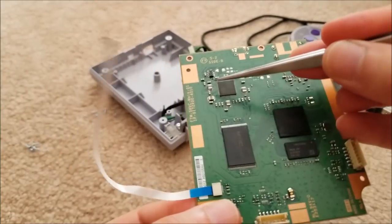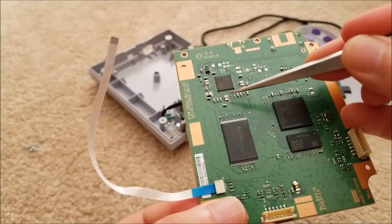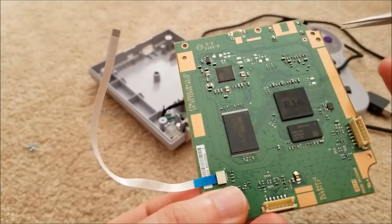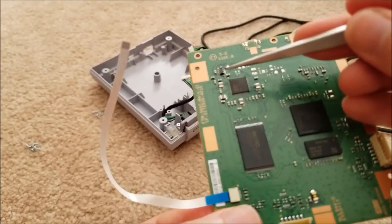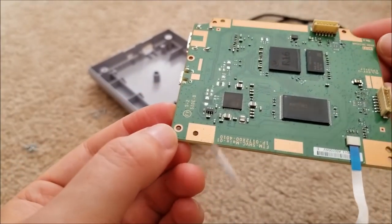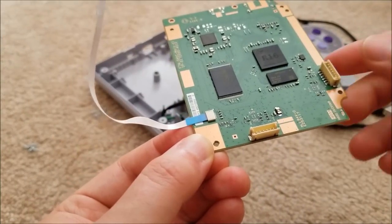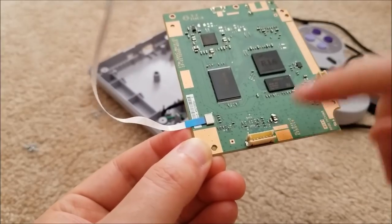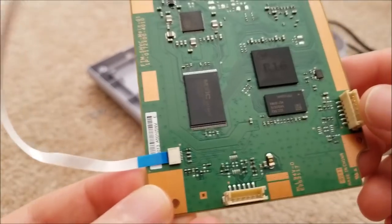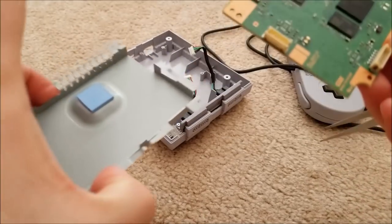Here's the actual flash memory, which stores all the games as well as essentially the OS for the system. On the other side of the input filter cap is what I'd guess is the switching regulator — easy to tell because there are large capacitors right next to it. This generates the necessary core voltages from the 5-volt input rail. There's also a tiny 6-pin IC that might be for reset or power management, and an additional fuse likely for controller port protection.